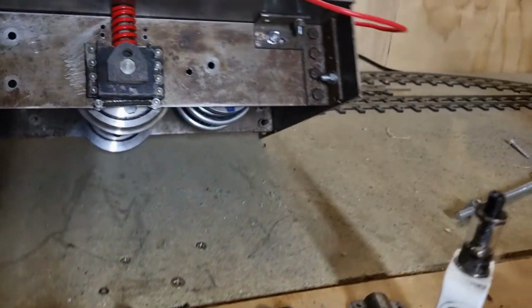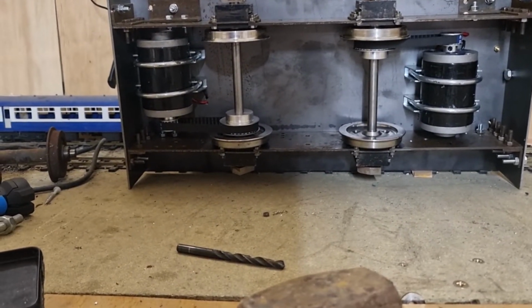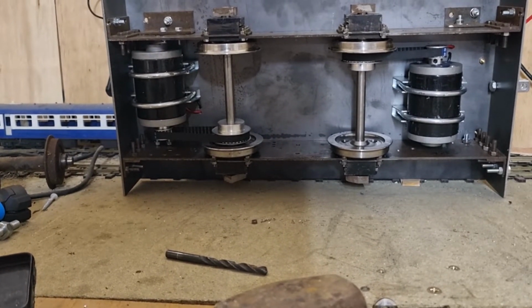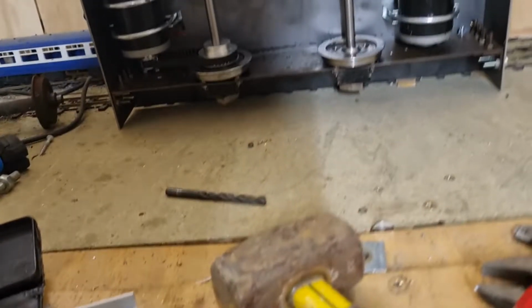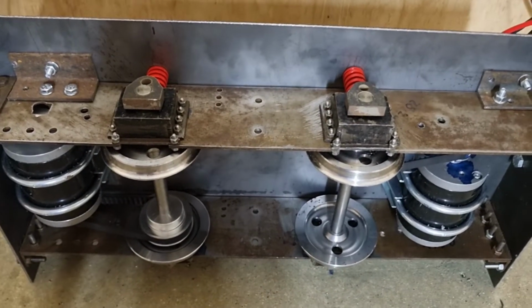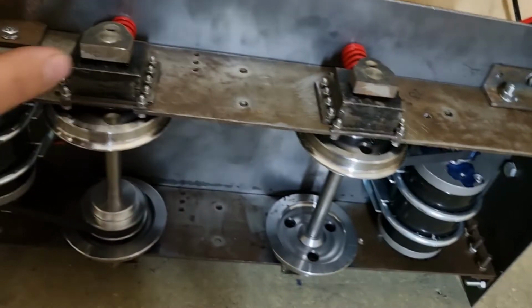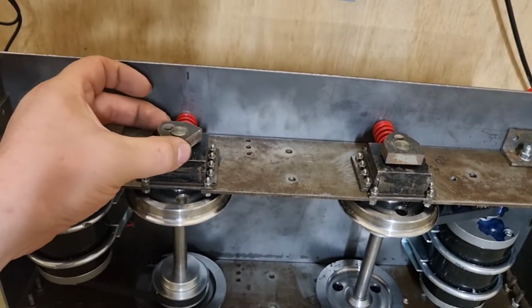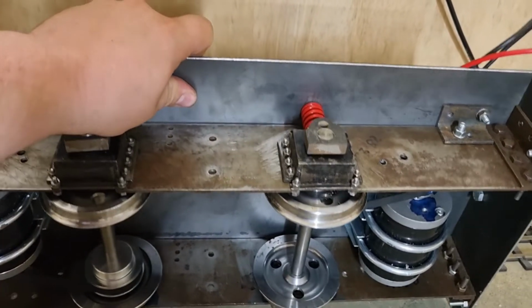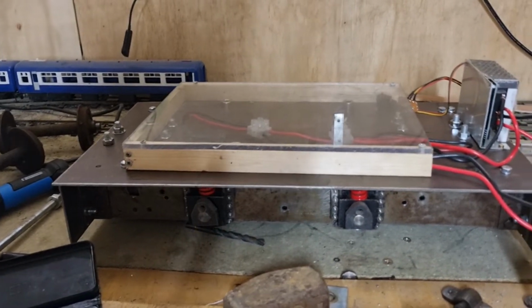We'll show you underneath. Flip it on its side. So there are the 2 wheels, 250 watt motors, and then 2 drive belts. And I actually managed to get those tensioned up just by bolting them on, just by pulling them far enough back. But as you can see, it's all ready to go. The cranks, I haven't glued them on yet, but they'll be glued on. Also, I'm going to put a grub screw in here. Once they're both set, I need to quarter them up, so one side will be facing that way and the other side that way, roughly, so that they're quartered. They don't really have to be, but I'm just doing it to make it look right. But that's all done. Oh, there's some weight in there. But as you can see, it's coming on quite well.